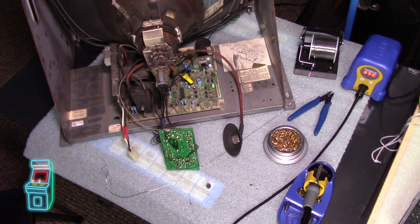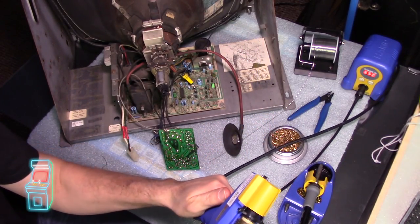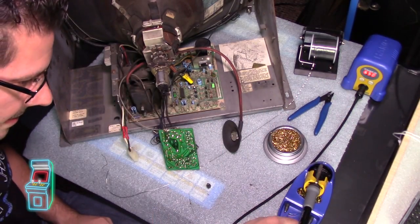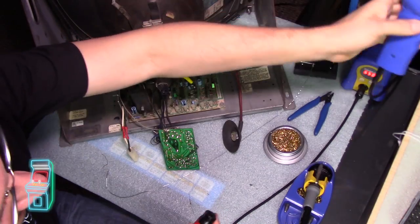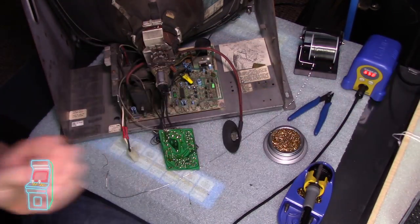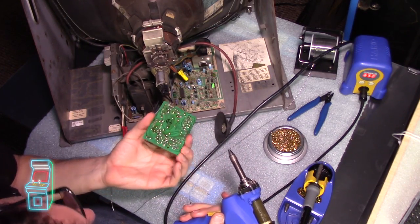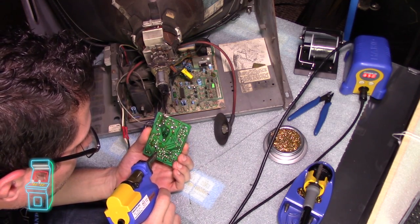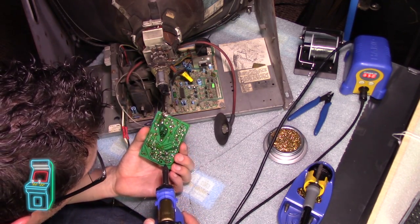The monitor fired up. I'm turning on the TPG - there we go, we got a signal. The image looks terrible. I'm going to adjust the pots on the neckboard. I can see red, green, and blue labeled. Starting with blue. Switching test patterns - that's supposed to be color bars. Each color bar, then a convergence pattern - convergence is already off. That's supposed to be color bars too - this is probably the worst monitor I've ever seen. I'm turning the red pot left and right all the way - nothing. Drive pot for red - nothing. Green pot - nothing. It needs a rejuvenation, or it could be a completely dead tube.